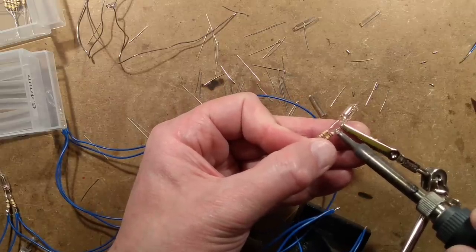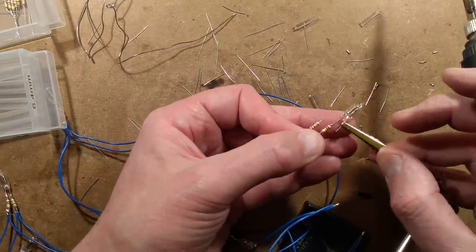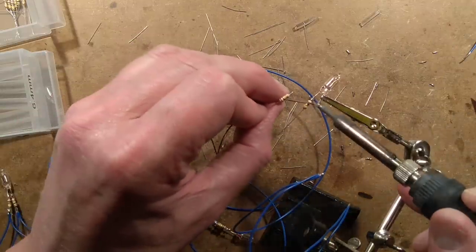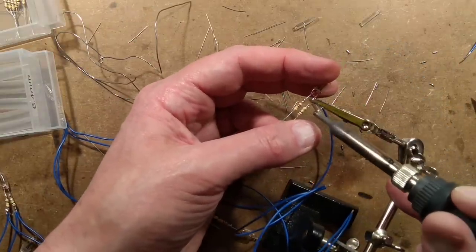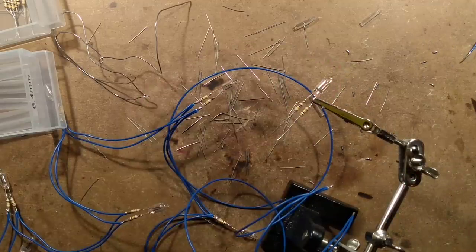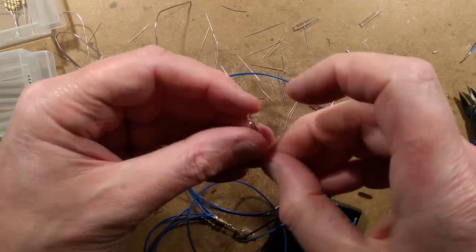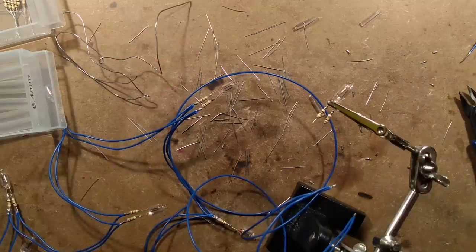Flow this onto the last neon. Flip the neon round, splash the solder. This is probably not going to be too visible for you watching this because it is very small, spindly wires. Looking pretty good - crop those leads, grip it and solder the wires on. Then I'll put the heat shrink on all of them - I'll cut them all to size first and then use the heat gun to shrink it all down.